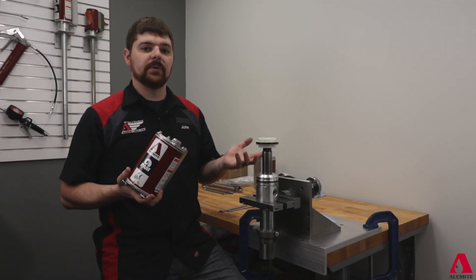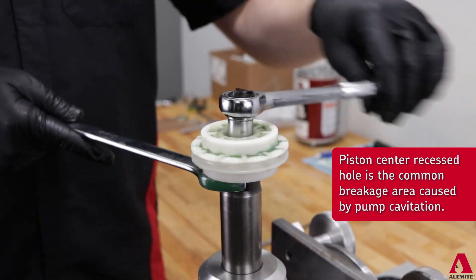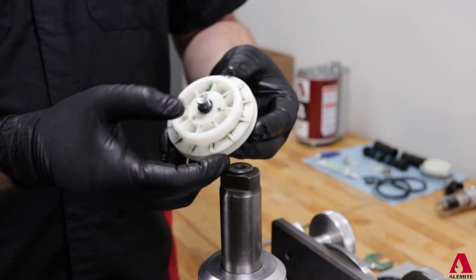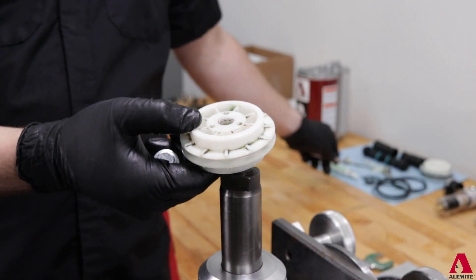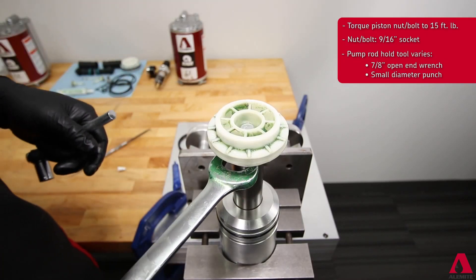The second option is to go ahead and rebuild the motor, which we will get to in a moment. Rarely does the piston break, but still remove and examine for cracks should the unit have cavitated at any point during operation. There is one o-ring to seal the center hole, which should be replaced when the piston is removed. Add a small dab of threadlocker to the bolt and reinstall the piston to the pump rod.